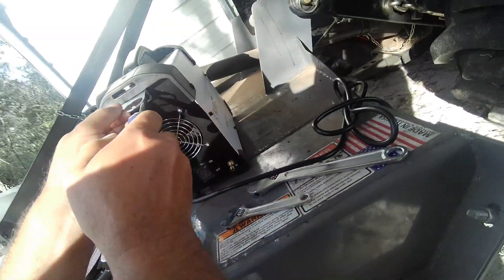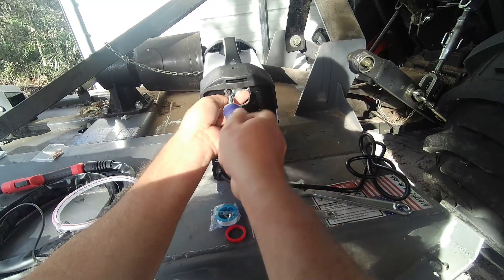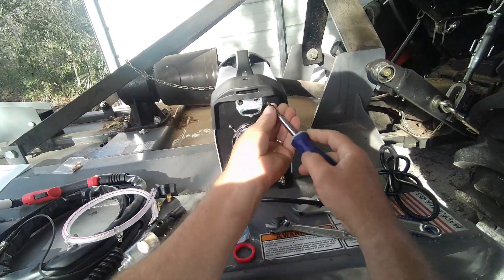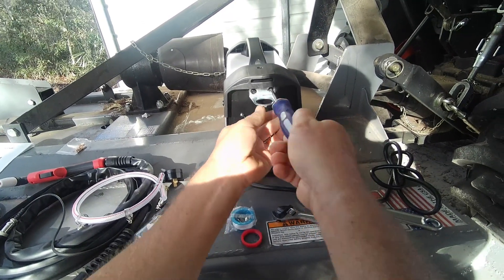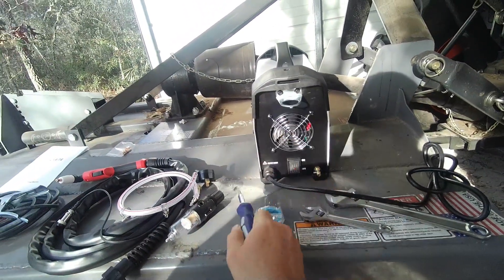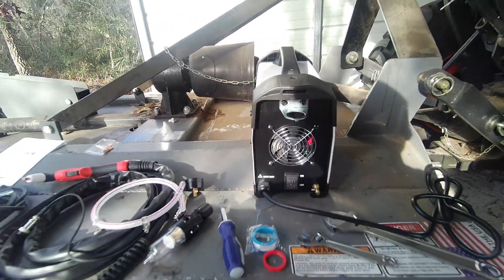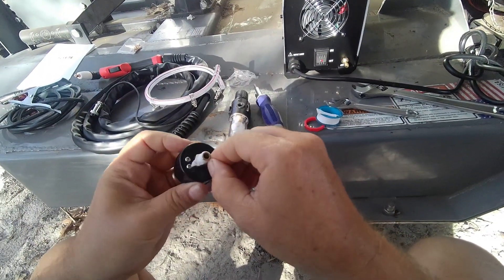I have a set of torches and a plasma cutter. I think the plasma cutter was one of the best investments I've ever made as far as welding fabrication goes. The only time I ever get my oxy-acetylene torches out is if I have something really thick — anything half inch or under I use my plasma cutter. So this plasma cutter will be my Florida plasma cutter. I'm going to be getting different tools to set up my shop down here — I don't really have a shop right now, I have a container, but soon I'll have a big steel building.